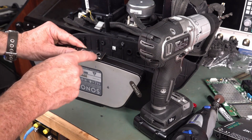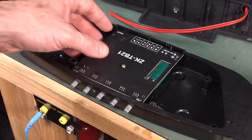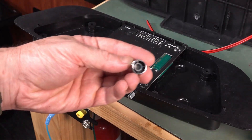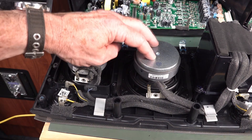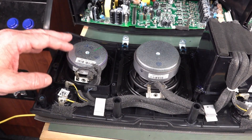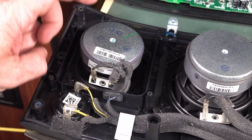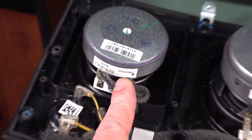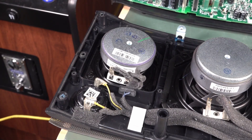That worked. I don't even have to have the threaded part actually penetrate out — that is a perfect fit, it is not coming out at all. Beautiful. Now unfortunately the supplied knobs are these deep recess types and they don't fit on there. The subwoofer is controlled by its own amplifier with its own low-pass filter on the PCB. But we've only got the single left-right speaker output, so we've got a two-way speaker system here. We need to measure the impedance of the woofer and the tweeter. We do have this — it's a Peerless four-ohm jobby, reasonably decent. Maybe the tweeters are Peerless as well.